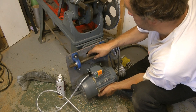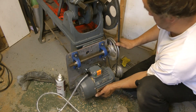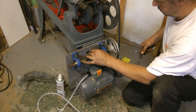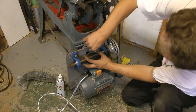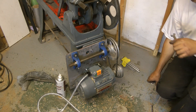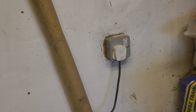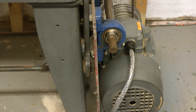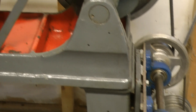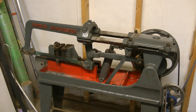Just a simple matter now of bolting on the new motor carriage assembly. I like this — it's like a quick release. I don't remember making anything this good. So we have single phase supply going to a variable frequency drive, which in turn powers a dual voltage three phase motor that's been configured from star to delta, and that now powers the power hacksaw with variable speed. If I'm cutting steel I can slow the speed down so it doesn't burn the blade, and if I'm cutting aluminium I can speed it up to save time. Let's start it up and see what happens.